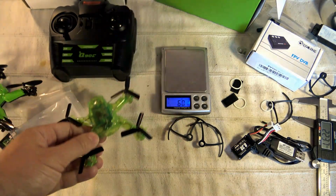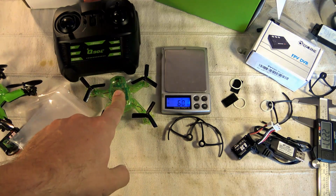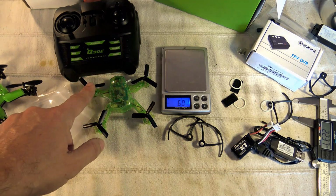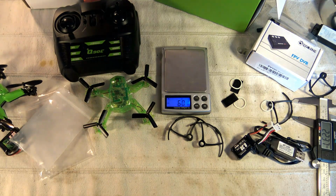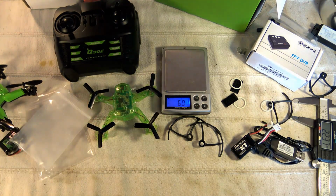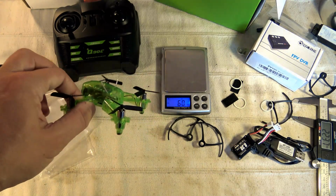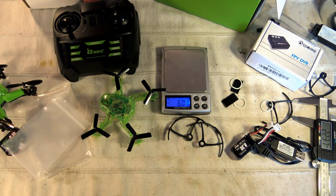I strongly advise it. Like any brushed quadcopter, and especially for 2S, I strongly advise also stocking at least one clockwise motor and one counterclockwise. Especially in 2S, the motors are even more stressed because there is a higher load on them, and their duration will decrease, so expect to change them every 20-30 flights. Unfortunately, you will need to unsolder the former, broken one, and resolder the new one.